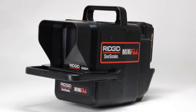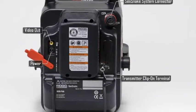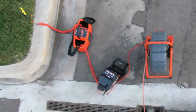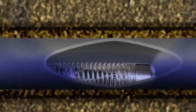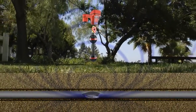Now let's take a closer look at connecting a line transmitter to the clip-on terminal. Connecting a RIDGID line transmitter to the clip-on terminal lets you apply a tracing signal directly to the C-Snake push cable, so you can follow its path out to the transmitter beacon, or sonde, which is located inside the spring right behind the camera head. When the sonde is activated, it transmits a signal that can be located with a RIDGID receiver, so you can pinpoint the camera's position underground.